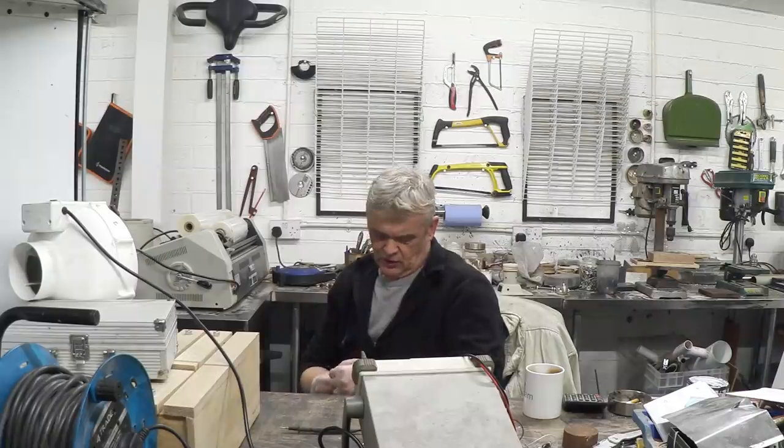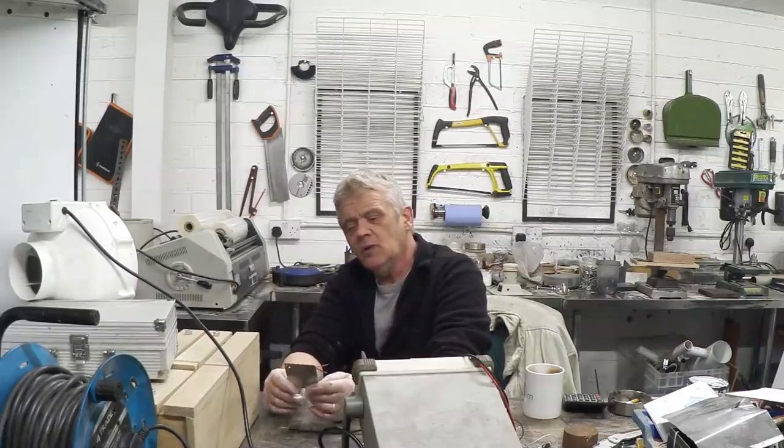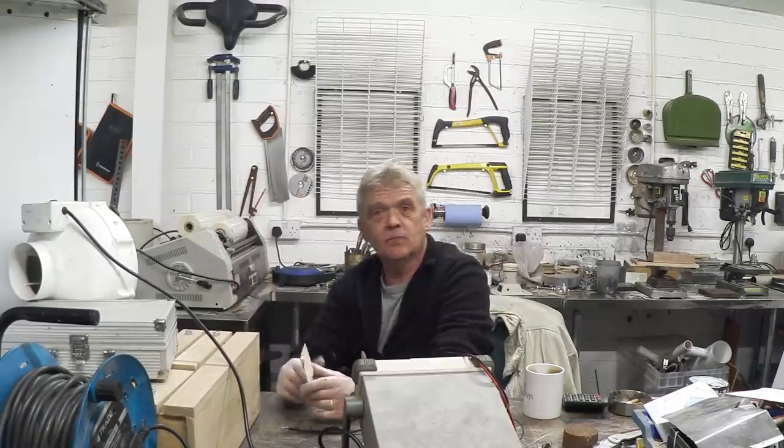If we get anything more than that we're doing awesomely; if we get that, we are actually performing the same as a one kilowatt generator — so to me it looks very promising that this whole thing is going to work as well or slightly better than a commercial generator. A lot of this is my guesswork, but when I connected those in series or parallel there wasn't enough from this blower to spin the rotor. The minute I put that little capacitor in, the whole thing started turning. These loads — this is a 31 volt 700 milliamp load — it will begin to work down to about 50 or 100 milliamps, and that's where I'm getting the three-watt figure from at roughly 10 to 12 RPM.